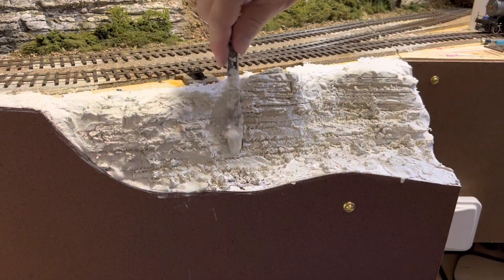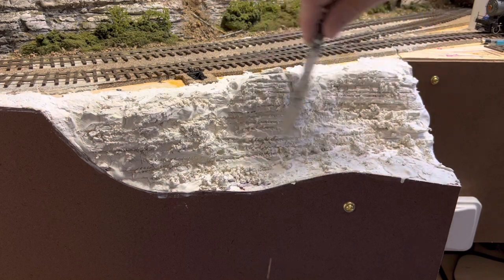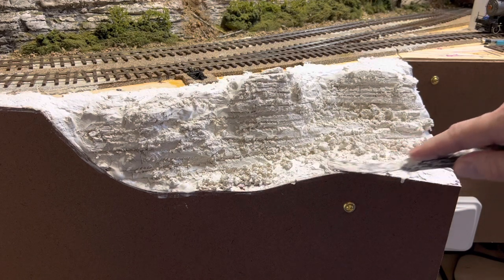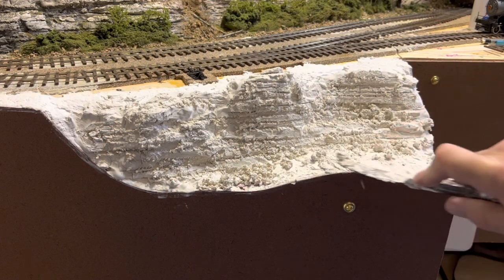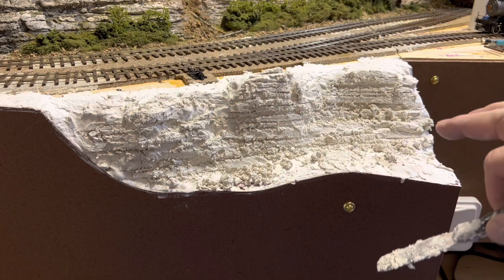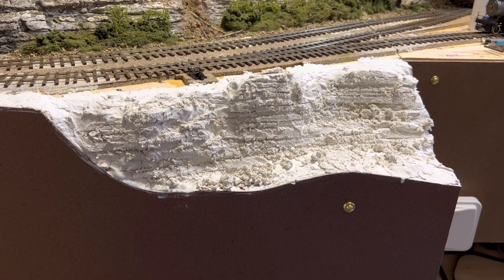What I'll do is just run this over a little bit, kind of flatten out some of the spots and knock off a little bit of the crumblies. Stuff that gets on the floor — just let it sit there because it will harden. Now from this part, we'll let it sit for a few minutes before coming back in with the wire brush. You do want it to firm up pretty good. You want the nubblies to dry so the wire brush takes them off. And then once that part is done, that's ready for the stain.